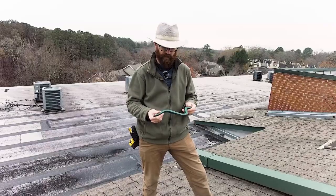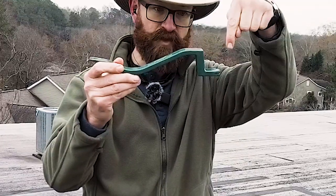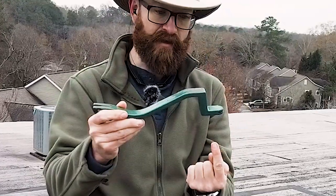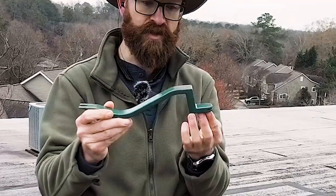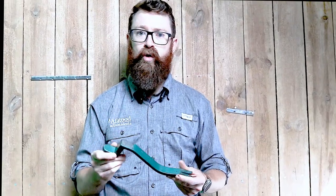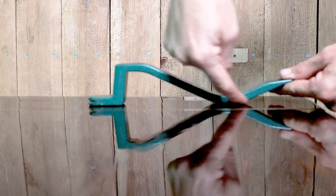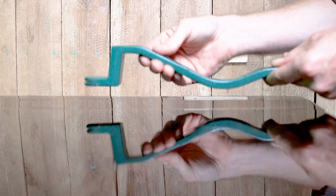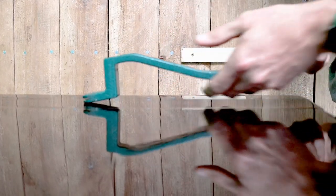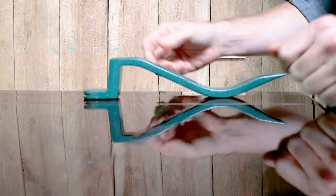There are inherent problems with the tool. The way that it's designed, you put a nail in here, and you have to strike this spot, which is off-center, to drive that nail perpendicular to the plane. In order to do that, you have to hold the tail end of this somewhere. This tool is flat. In order to drive the nail perpendicular, the tail end has to be completely flush — I push the entire way down. If I have to hold this tool, I end up lifting the head up and driving the nail at an angle. There is no way to hold this tool without driving the nail at an angle.